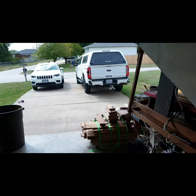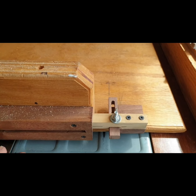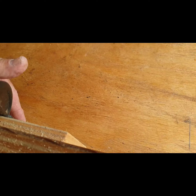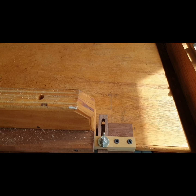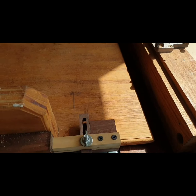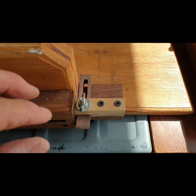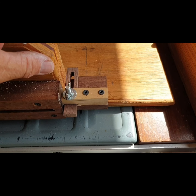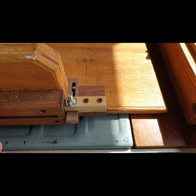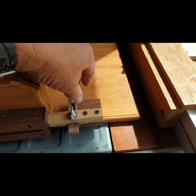While I was getting that done I made this little gizmo — it's just a slide, or a step stop, on the fence on the outside. I can use a clamp and a board on this side to cut my dimensions, but when I get out further I can use a stop so I can lose it out in that area. The fence is in the way there, but anyway the stop is out there and I can push it back in or out, then tighten it down to stop it.